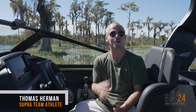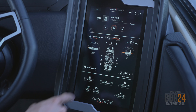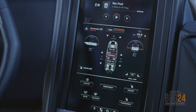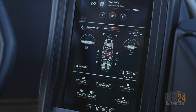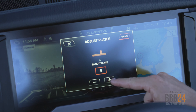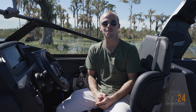My name is Thomas Herman. I'm part of the Supra Pro wakeboard team, and I'm going to talk to you about how I set up my profiles. When you first hop in your brand new Supra, you're going to see a whole bunch of profiles already made for wakeboarding and wakesurfing. When I hop in the boat, I've made a custom profile with everything how I like it: the ballast fully weighted up, the plate system at 15, and the speed at 22.6 miles an hour. The way the plate system works is the lower the number, the steeper the wave is going to be, and the higher, the more mellow it is. Even if you've made a custom profile, you can always tweak it and make little changes along the way, save it, and it'll keep it up to date.